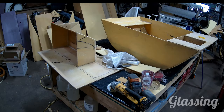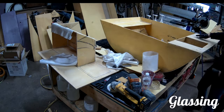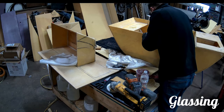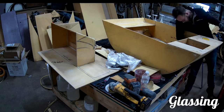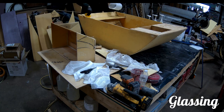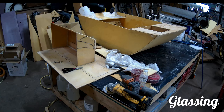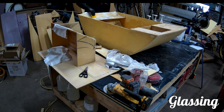So here I finally start cutting some glass, and I remembered that I always tried to bite off more than I could chew with the fiberglass. So this time I just cut it into nice square sections and then overlapped the sheets so that some places were thicker and some thinner, but it didn't end up being a problem. I think it's the right way to do it anyway — I'm no expert, I'm just winging most of this. Trying to cut out the actual shape of things and have a pattern for the glass ended up just being way too much work, so it was just easier to cut these small squares and glass everything in manageable small sections.